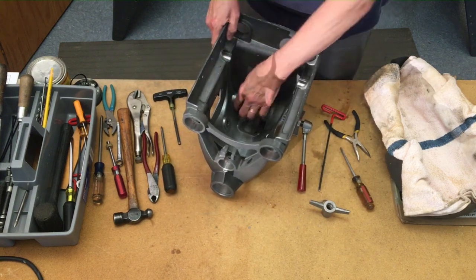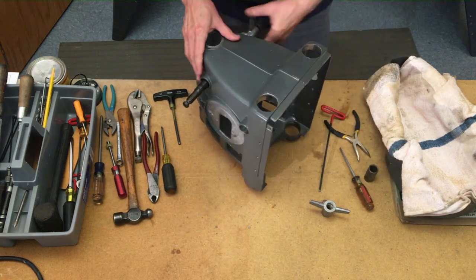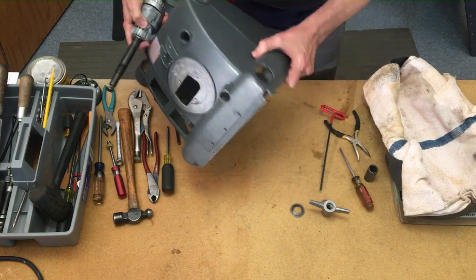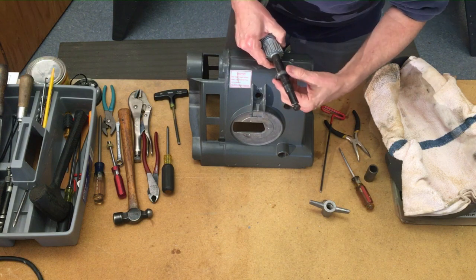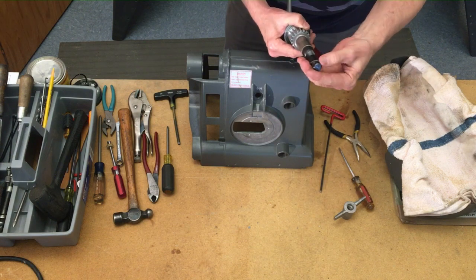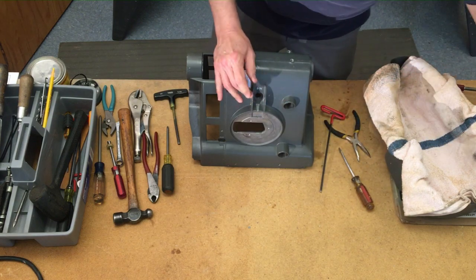This set screw has a special point — it's meant to dig into the spring housing, with little knurls or teeth around the cup of the point. That digs into the housing and doesn't allow it to rotate. This other screw has a dog point. Don't mix these up. If you put the knurl point in where the dog point belongs on the quill, you'll scratch the top of the quill. And if you put the dog point in on the depth stop, it won't hold the position on your spring housing. These are important to keep separate and put in the right place when reassembling. There's a sleeve on the inside that comes off — save that. And that'll help loosen up the quill housing. Remember the washer — that goes on to squeeze the ears. Even though you're not going to use the center shaft anymore, you're going to use the locks, the spacer, the handle, the depth stop, and the washers on your new one.